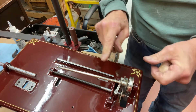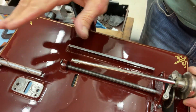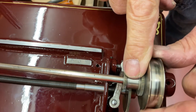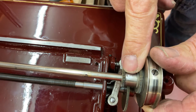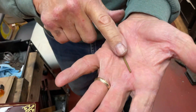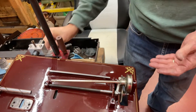In working on this, I had to re-nickel this, so I had to take this little washer out right here. This piece here moves back and forth — it goes in the slots of the mandrel, and then you have to take it apart right here. So if you look closely at the end of that pin, and we'll rotate it over, you'll see that pin is a little smaller. What they did was they put a tapered pin in. Both of them have a tapered pin. The hole is minutely bigger at one end than it is at the other, and they put a tapered pin in to hold them.